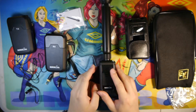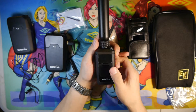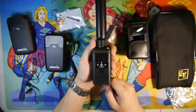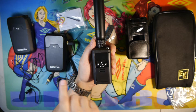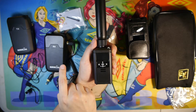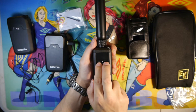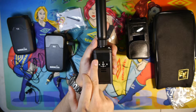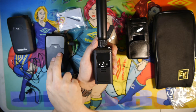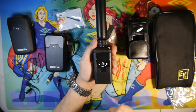To activate this unit, you're going to slide down the front panel, and you can see it has a bunch of buttons. If you want to pair this unit, instead of pushing the red button like you would on the receiver or transmitter of the Filmmaker Kit, you would hold down these two buttons. In the top left corner, you would see a P pop up. Then you would go to your receiver, find a channel you want to pair with, push the red button, and they would sync up to that channel.